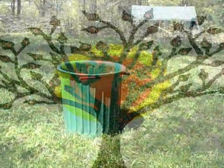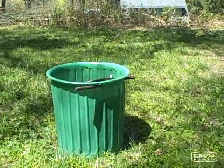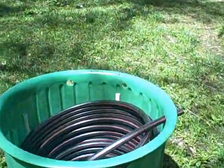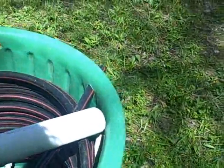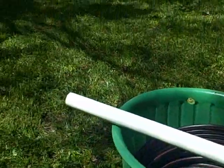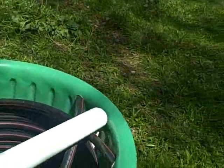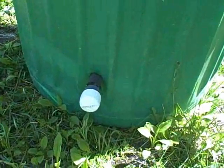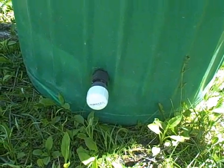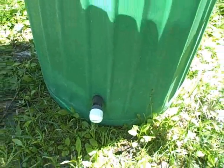What you're looking at is a carry barrel. It's used to collect garden debris, but we can also use it to collect solar heat. By just connecting a pipe from the collector — I'm just going to put this PVC pipe here — we have hot water from the collector entering the top of the tank. You're going to get some circulation from the tank, and you'll connect a pump towards the bottom of your tank, right here at this spigot, to return the coldest possible water to your collector to collect more heat.